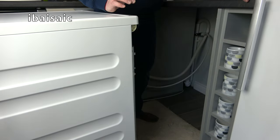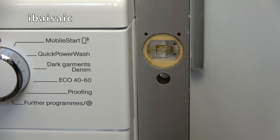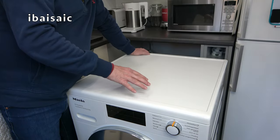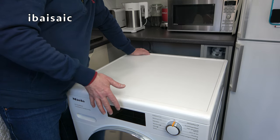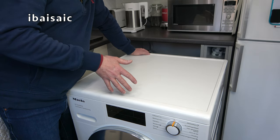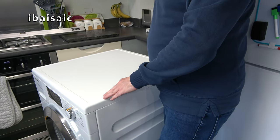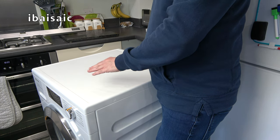I've checked my connections are tight and there's no water leaking from the cold water inlet. I now need to remove the protective carpet and make sure the machine is level. Your washing machine needs to be level, and it's best to install it on a solid concrete floor. Use a spirit level and you'll find four adjustable feet underneath the washer that can be easily adjusted using the provided spanner. The floor I'm installing on is solid concrete and pretty level, but I'll be very careful maneuvering the heavy machine into its final position.